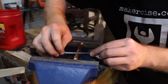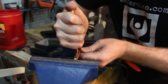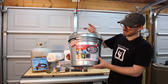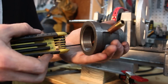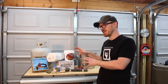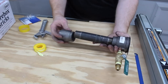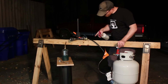I'll be using ceramic wool style insulation, as well as some fire bricks and a stainless steel stock pot. I previously used a six-gallon galvanized steel container, but I really wanted to stay away from zinc in the construction of this foundry since I'm going to be putting the plans out there. I felt like stainless was a much better option, so I went with stainless hardware and iron, not galvanized, pipe fittings.